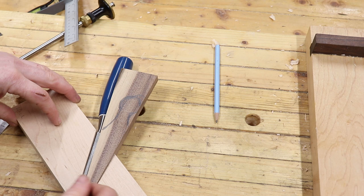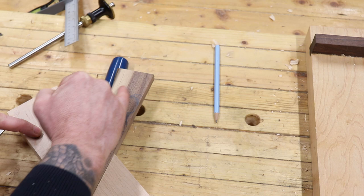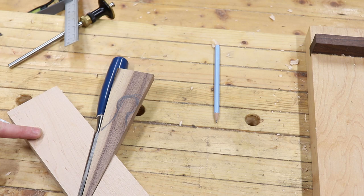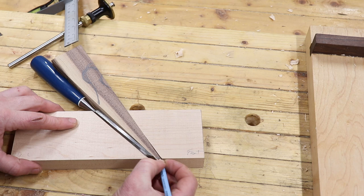I have it thicknessed down now. I need to cut out a recess in this to allow for the chisel - as you can see, it can't sit in with the chisel as is. I need to put a traditional design in it - they usually have a round top so you can tap them with your hammer, and a little groove so you can tap them back out as well. I'm going to take it to the bandsaw now and rough out this shape, then flush trim the end off.